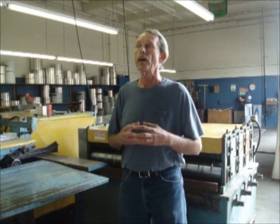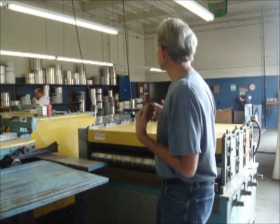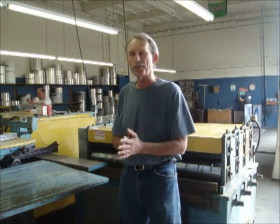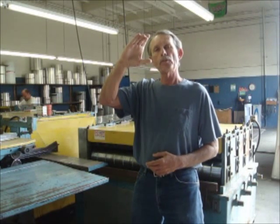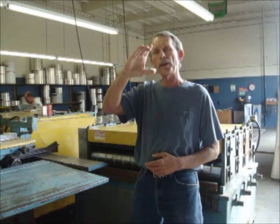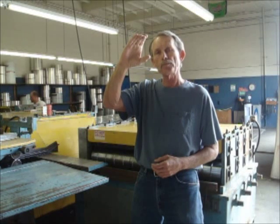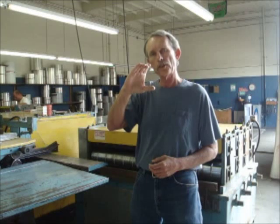What we have is a run that I don't even know what you call this. Do you have a name for this? Yeah, it's called the Larry Run. But basically it's a 4-inch break, and then if you move it over 5/8 of an inch and run it through with another 4-inch break, that's what you've got. So you've basically got a 3 and 3/8-inch break, then a 5/8-inch break smaller, and then another 3 and 3/8-inch break.